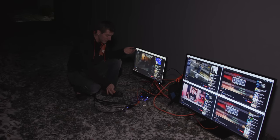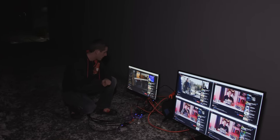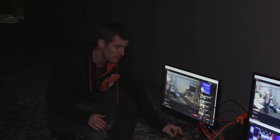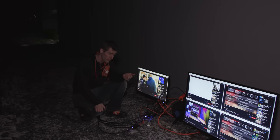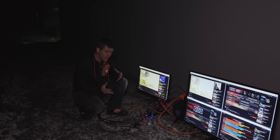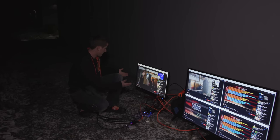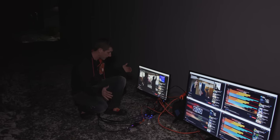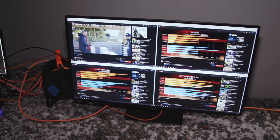So this is, what was it you said, Anthony? 8 point? Something like that, depending on the exact resolution. 4K 30 or 4K 60 at 420. Even though you don't have as much bandwidth as HDMI, as long as you limit some of your settings, be it resolution, be it refresh rate, or be it bit depth, you can get something that, to my eye, is not noticeably compressed over an Ethernet cable. Pretty freaking sick.